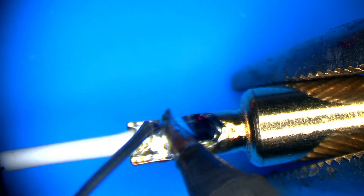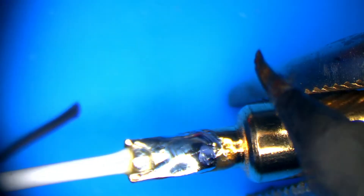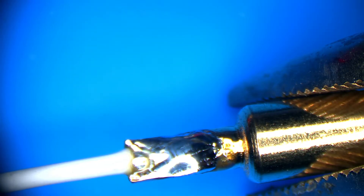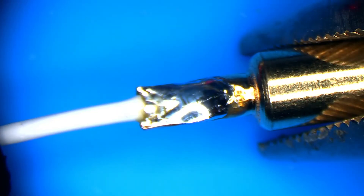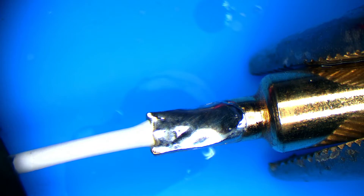There's not quite enough solder in there, but that's okay — we can go back for more. We'll fill that up, just like that, and let it cool off. Make sure the wire is nice and straight — and it is. Go ahead and clean the rest of the flux off. Nice solid joint. We'll turn our fume extractor off because it's noisy.